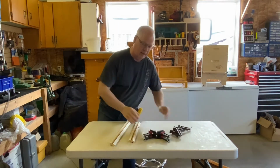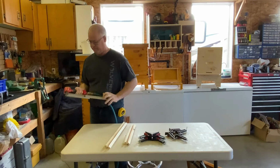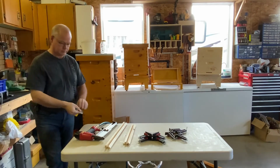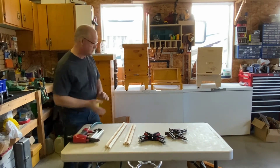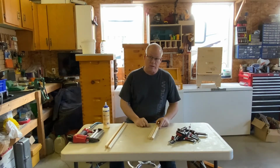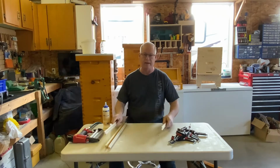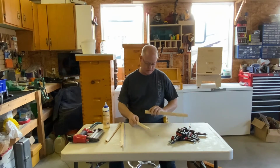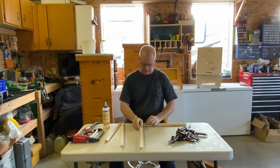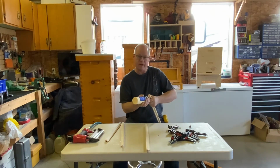As you know, I like my corner clamps and my brad nailer. We don't need 2-inch nails in this one though. Let me find some of those. And some glue. And of course, always get proper training and read the manufacturer's instructions anytime you're using the saws or tools or anything like that. So, safety first, right? Now what I also did is I marked all the outside when I was ripping these, just with a little mark, so I knew exactly what side was in and what side was out. Let's put these together.